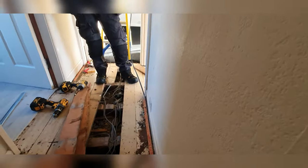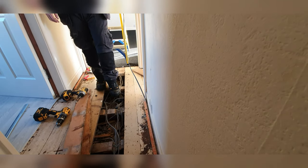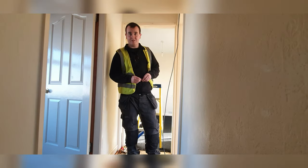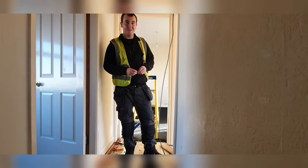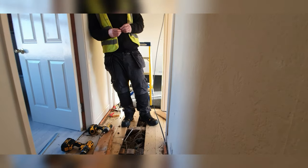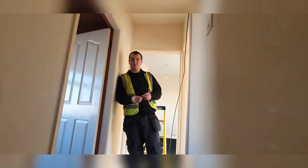How's it going Mike? Alright yeah. So basically that cable was short at the beginning of the video, it was hanging off. We're screwing it back - it's going down there instead of being over that door. Easy peasy. Put the 1mm on that JB, chucked it down. We do love a downlight with one end in. And all there is then is a couple of smokes and I'm going to take that off and put a blank plate on.